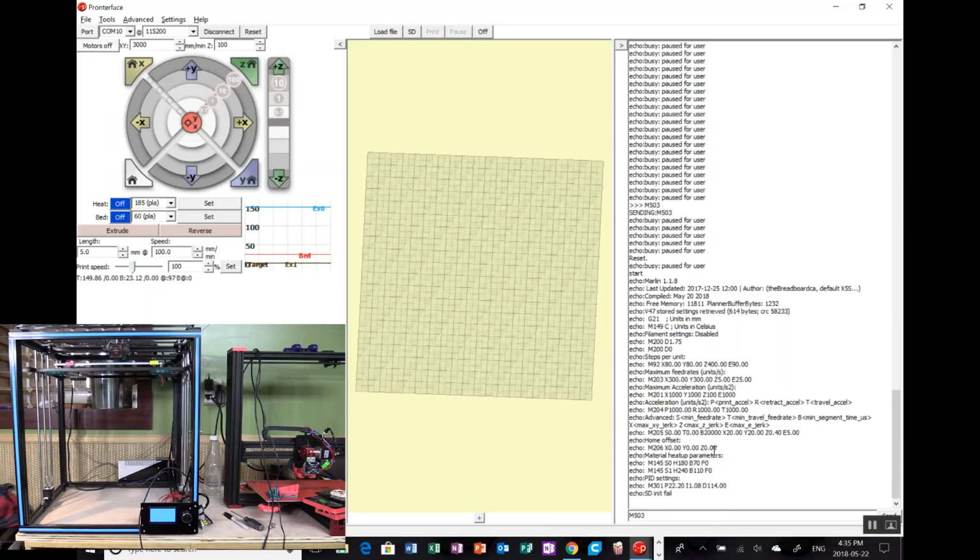Anyway, it's not about running G-codes and everything else, which this test was. It was about upgrading the Marlin. So unfortunately, during my process of taking the board out and putting it back in again, it looks like I might have messed up a couple of the pins on the Mega 1284 chip. I've never had that happen before, and I don't know why it would have happened this time. Like I said, I've tried changing the display, and I've also put the displays on a RAMPS 1.4 board, and the displays work perfectly fine. I've also taken this exact same code and simply changed the board type to a RAMPS 1.4 and compiled it and uploaded, and it works fine as well, which means all the libraries are okay too.